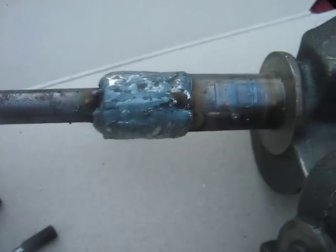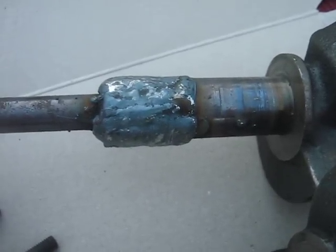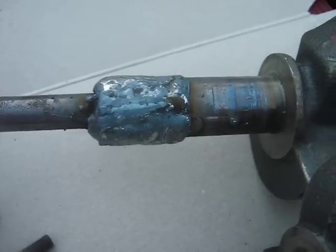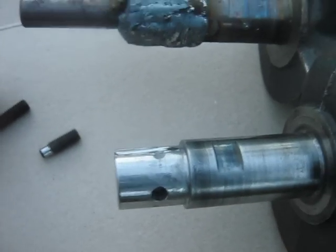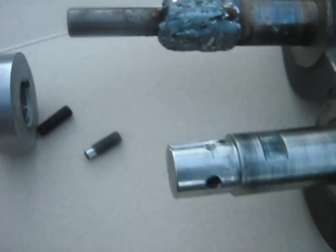My friend at ACDC Welding welded up the crankshafts, turned the cone that the flywheel mounts on — the taper — welded it up and then machined it down into a straight 3-quarter inch piece like that. Then cut off the recoil starter mount and all that.